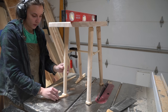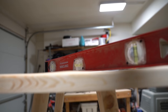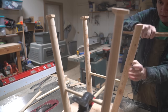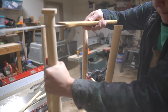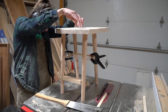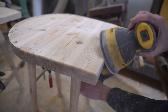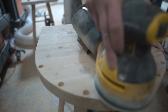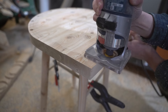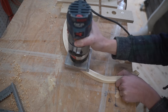With the base joints structurally done I got to work cutting the legs so the stool would sit level. Then I did a finishing level sand down and rounded over the edges, including the back edges, before assembling the backs to the stools.